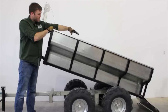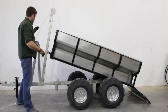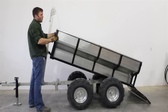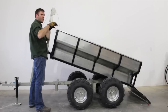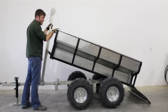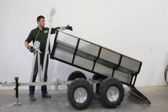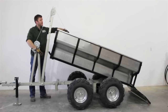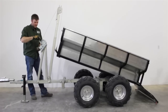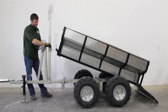The friction on the ground means you need to apply a lot of force with the winch to get material up into the bed, but this setup lets you use the full force of the winch and more of the trailer's capacity. With the swivel boom you're limited to about 400 to 450 pounds of lifting, whereas now you've got the full ability to pull 2,000 pounds up into the trailer — whether that's logs, game, or whatever else. To unlatch, you'd pull your material up into the bed using the winch lead, then take the winch lead off the material and stow it back up the boom.